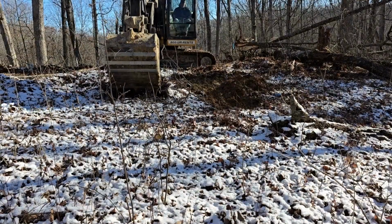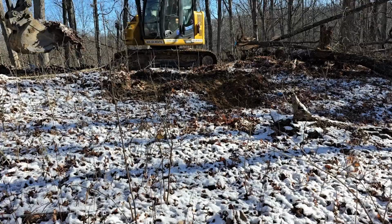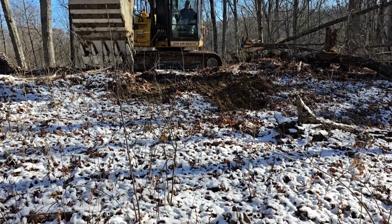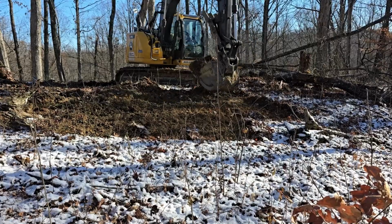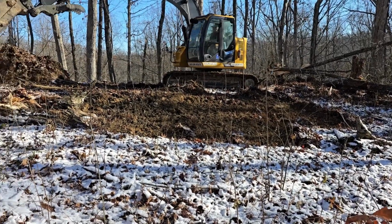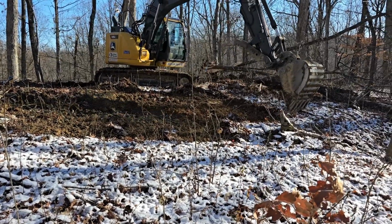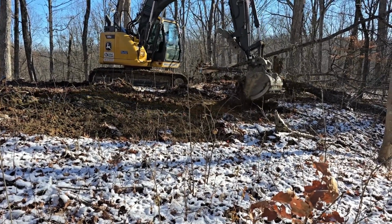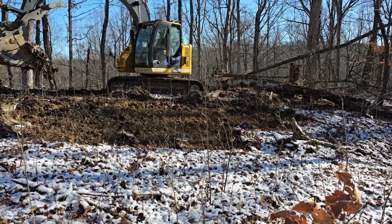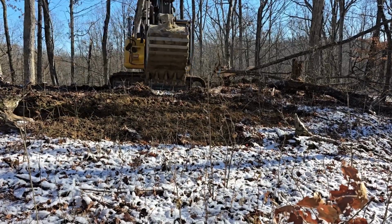The next step was to remove the topsoil from the surface of the ground. The topsoil was placed in piles along the edge of the work area where it would be later returned to the finished wetland. The topsoil is dark colored and contains fine roots. The excavator removes leaves, shrubs, and topsoil to a depth of 10 inches to expose the light brown colored clay soil. The main reason the topsoil is being removed is that the material can't be compacted to hold water in the wetland that's being built. The process continues until all the topsoil is removed from the work area.